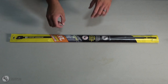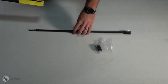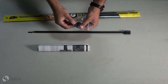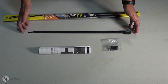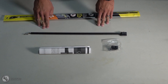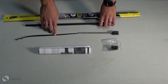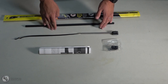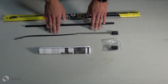Let's see what's inside the package. You'll have a set of fasteners, one end bracket inside this package, which we'll see when we're doing the installation. You've got your installation manual, and then you actually have the rod here with another end bracket already attached to it. Inside of this rod, if we slide it apart just to give you an idea of how this is working, we have a nylon strap and a spring that creates tension when you open the screen door, so that when you let go of it, that tension compresses and the door closes. That's simply how this thing works.